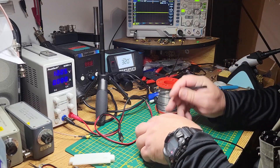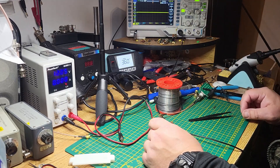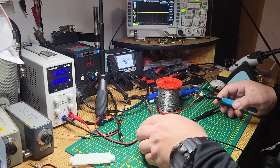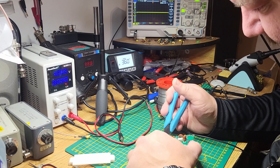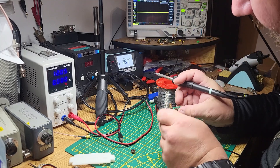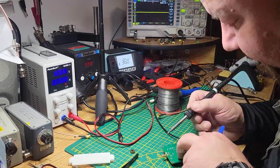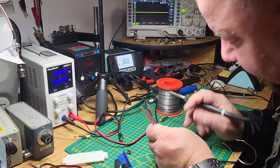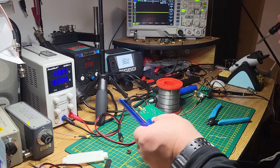It's important to show how to unsolder these toroids, because at least two are on ground and are really hard to unsolder. The universal trick is: cut them, and then simply unsolder leg by leg.